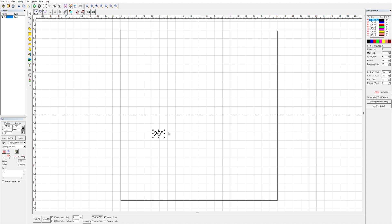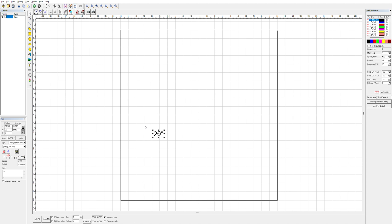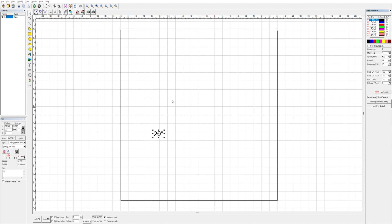If you do 'show contour' it will show everything, which is a nice feature because sometimes something is too complicated and you can only show the outline. I was going to do some kind of outline or box around it but I really don't think that's necessary. If we click on this you can see it has hatching — hatching is when it actually fills in the text. So we have a hatch contour, meaning it's not only going to do the outside edge but also fill it in. Once we get everything lined up we just hit the foot pedal and change the numbers each time. The only other thing is to set the parameters — I'm using 'steel general' from the library, which I loaded in the previous video. I think that should work fine.